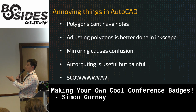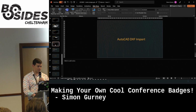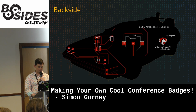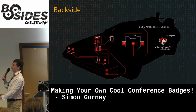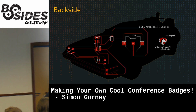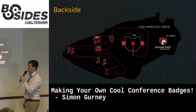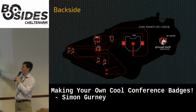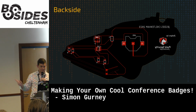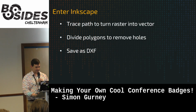So that's a thing. The mirror causes confusion. If we go to this one, everything's back to front, which is really useful when you're looking through the board. You might turn another layer on to see whether these LED rails line up with the front bumper. That's exactly why it's mirrored in the first place. But you might not realise that, and then get a load of boards printed with your words back to front. So it's meant to be back to front. If it's back to front, you're doing it right. Don't engineer a complex way to flip the text and then get it printed.